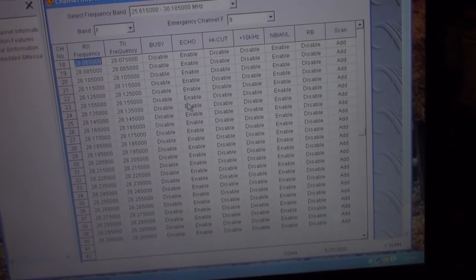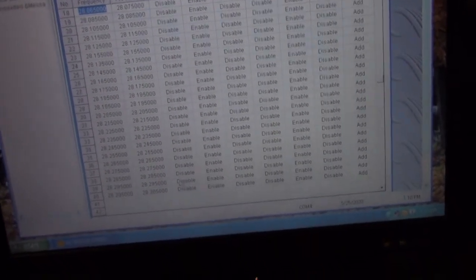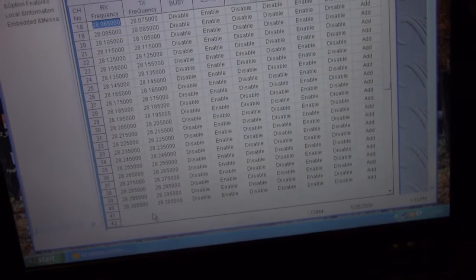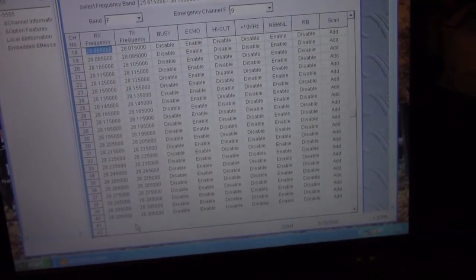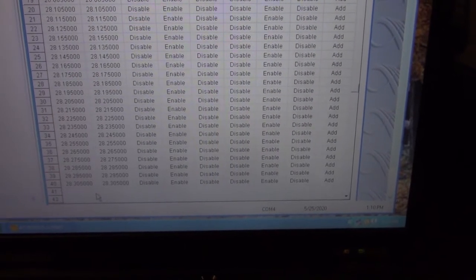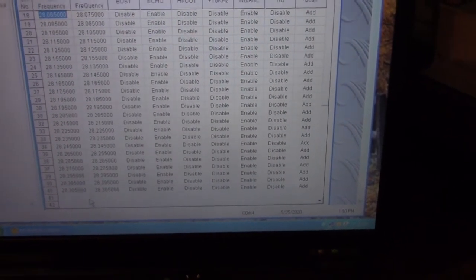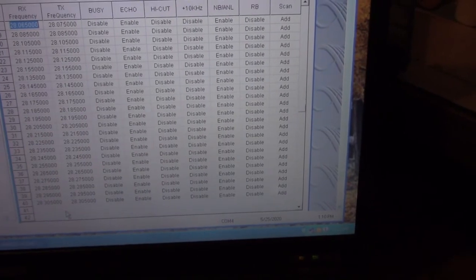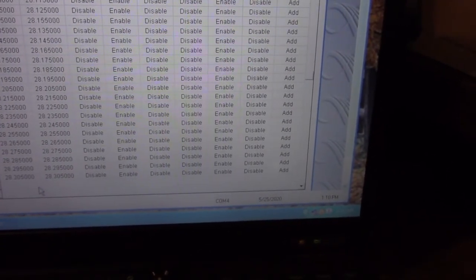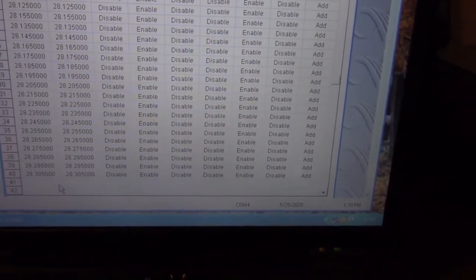Just entirely FM frequencies — or maybe some AM. The way it was programmed from the factory: it comes out of the box in 10-meter mode with all six banks as 10-meter frequencies and 60 channels per bank. But with the front panel sequence you can switch it to export mode, which makes it do 11 meters and CB, with all the CB export frequencies for various international 11-meter bands — various CB channel sets for different countries, because different countries have different channel sets.